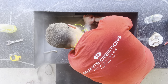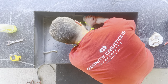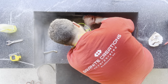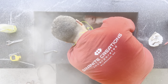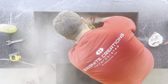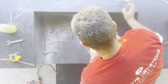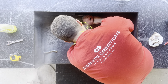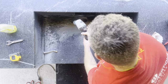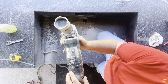I'm going to crank this all the way up and get to drilling. It does make a little bit of dust — get yourself some water and squirt it. Make sure you're not breathing in all that silica; it's really bad for you. And shameless plug: I do work for a granite countertop company, which is how I was able to get my outdoor kitchen island countertop and this lower shelf. It's just one of the perks of the job. If you don't have the tools, maybe hire your local granite company to come out and drill for you if this is something you're up against.